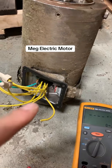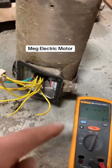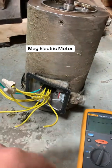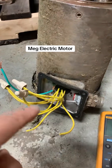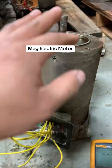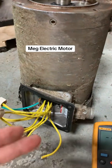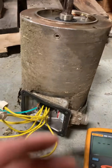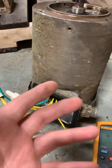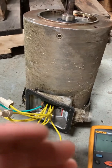I'm going to show you guys how to meg out your motor — test the insulation with an insulation tester — so that you know you are not just swapping out motors blindly. This motor is good, this motor is bad — I tested them. Sometimes people just swap out motors without actually testing to verify that they have a bad motor; they just start swapping parts.